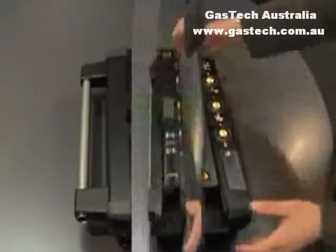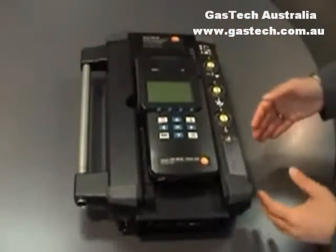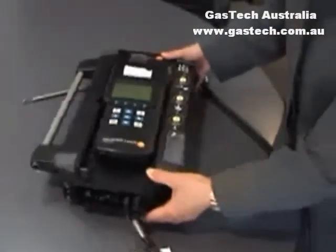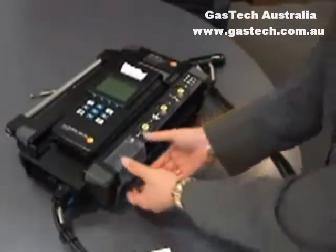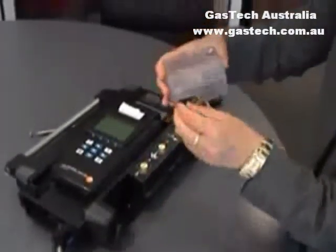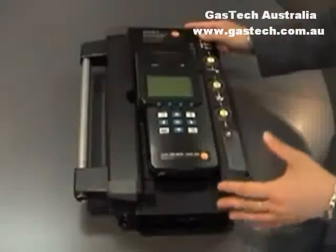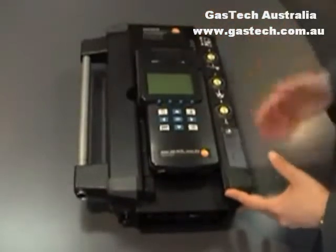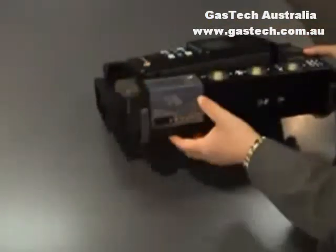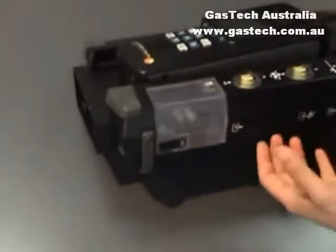This part is for dilution. We have a condenser trap here to trap out any water that comes through from the flue gas. To properly empty the condensation trap, take it out horizontally and drain the water. Inside the analyser box there is a cooling system so any moisture will come out into the condensate trap, which has level markings. When the water level reaches the mark it has to be emptied, but the analyser box must be switched off during emptying.